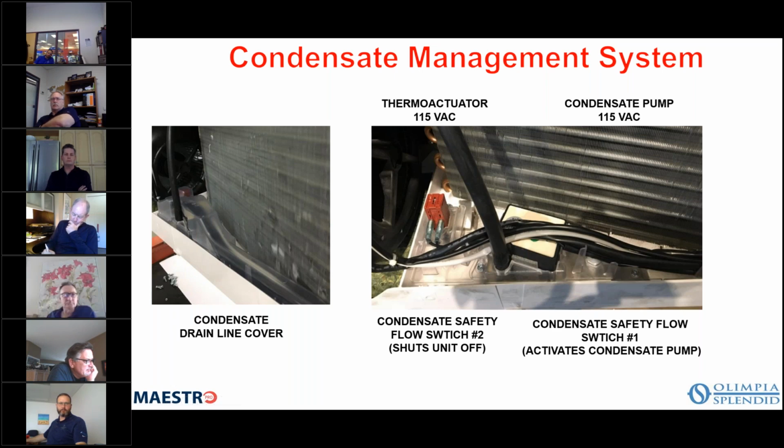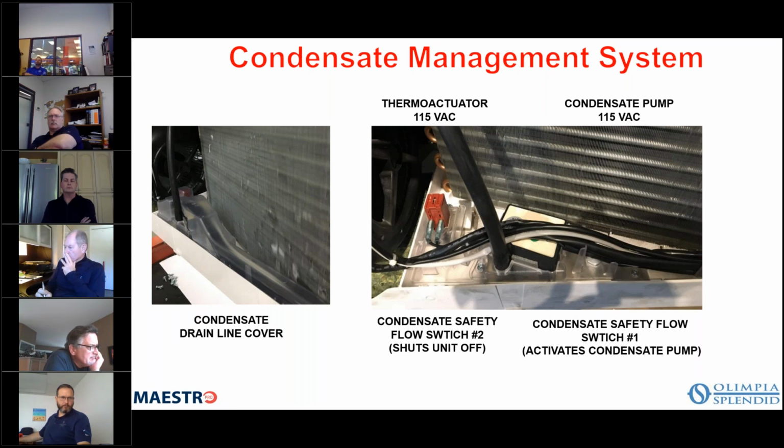Now, of course, in your part of the world, you may occasionally have temperatures below 32 degrees Fahrenheit or 0 degrees Celsius. And at that point, you'd want to make sure your drain line doesn't go directly to the outside where it will freeze, but perhaps somewhere else in the building or into a pump where you will pump it to somewhere in the building.